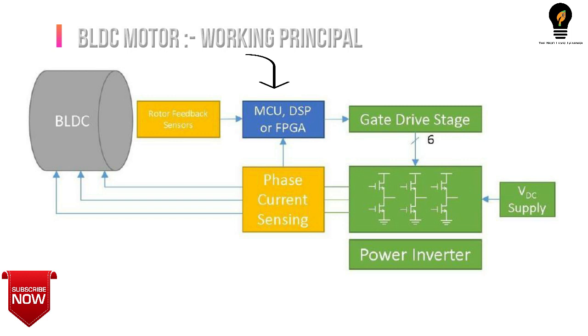Analog controls are still used but cannot process feedback messages and control accordingly. With digital control circuits, it is possible to implement high performance control algorithms such as vector control, field oriented control, and high speed control, all of which are related to the electromagnetic state of the motor.